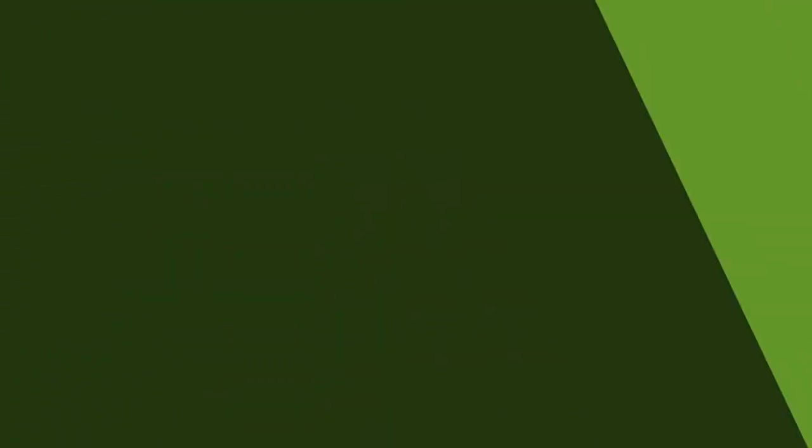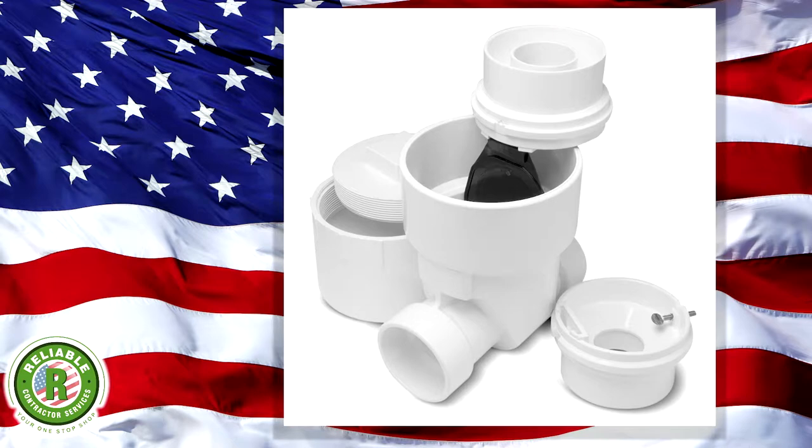How are they installed? It's a pretty simple process. We dig down to the pipe, cut a small section out, and install a backwater valve. Here's a good picture of a backwater valve — this device gets installed into the pipe. There's a riser that goes up on top, comes up to ground level, which allows us to inspect and service it if you ever have a problem. It also allows us to make sure it's working properly. We do recommend that people maintain these. We can teach our customers how to do it themselves to save some money, but it's always best to hire a professional and make sure you're getting the proper service.